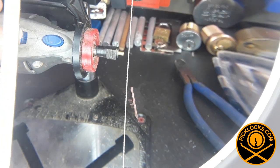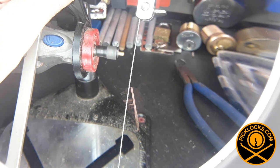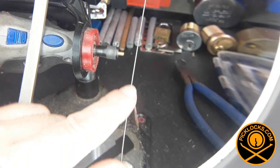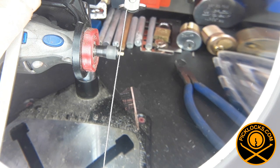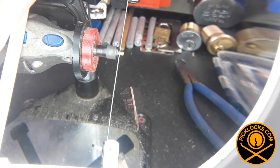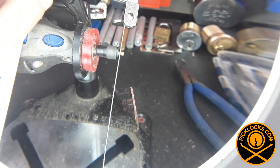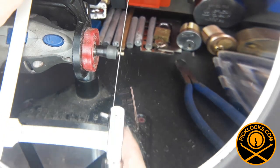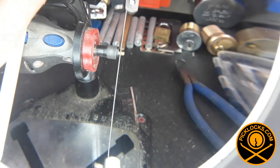We're already locked into place — let's fire this up and see what happens. We don't want to apply pressure in one area; if we do that it's going to heat it up and just burn right through. So we want to keep this moving at all times. Start out light, find a spot to work near the edge or the spindle. Just keep it moving up and down — that increases how long the blade lasts. If you hold it static, it won't cut and it'll burn right through the blade.